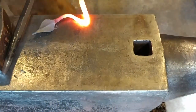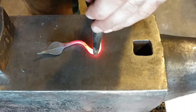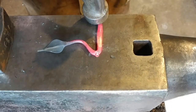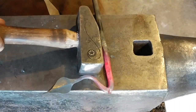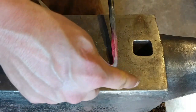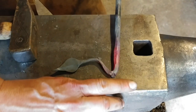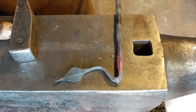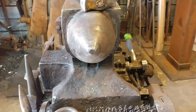Here we are, good and hot. We're going to get this set up half on half off, like I said, with the punch, and drive out that little nub — that's going to become the catch for the bottle opener. Next we'll go ahead and heat this back up and bend this leaf portion back around. That will become the part that goes over the top of the bottle cap so we can lift off the cap. I'll readjust the camera so you can see how that looks from the side angle — we're almost done.